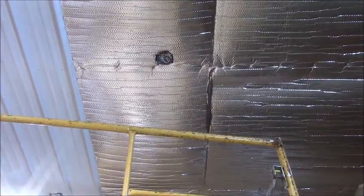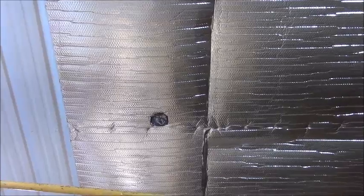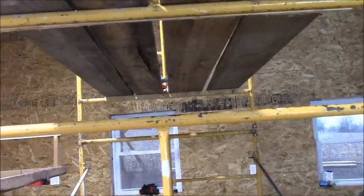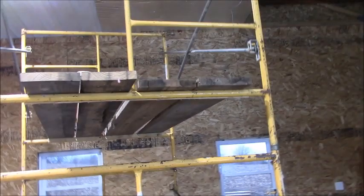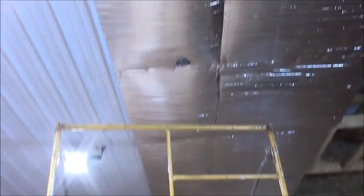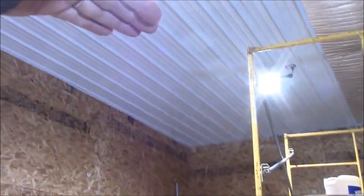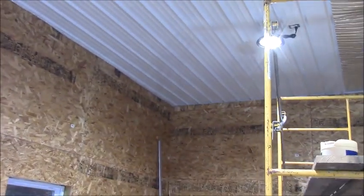What I'm going to do is get some SO cord, which is just that black rubber cord, and an octagon box cover with like a Chinese finger, and drop it down here almost to the floor with like a 10-foot piece. Then I believe there's a safety switch that it has to go over to first on the top of the lift and then down, so that if your car is coming up too high, it hits a bar at the top of the lift and keeps you from driving it through the roof.